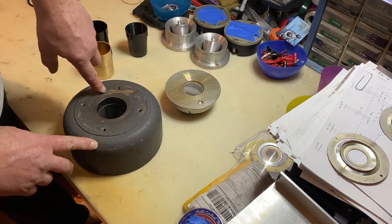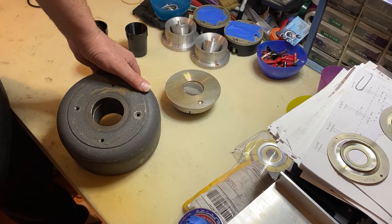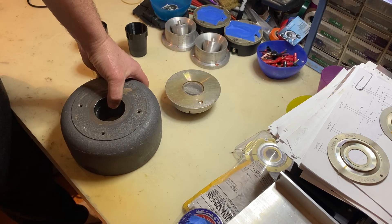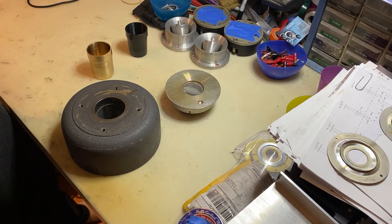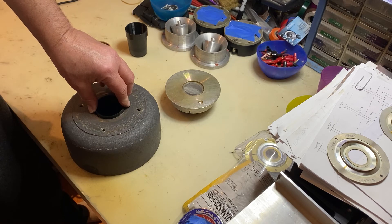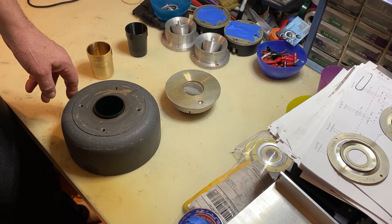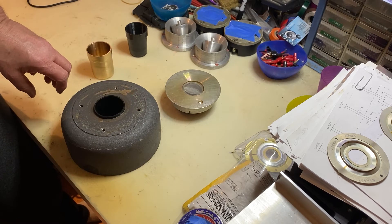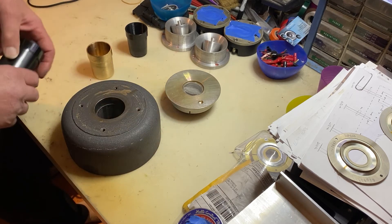Let's look in here. The magnet is right in here and it's only held in — you can see the seam there between the housing and the magnet. It's really only held in with magnetic force. It's not glued in or anything. What happens is they shift, and the throat fits in — it shifts in there. The throat is held in by the housing, then the magnet moves over and it cracks the throat.